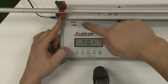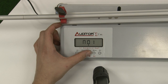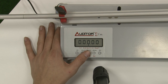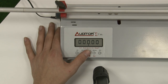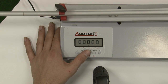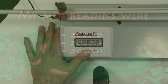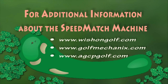Pull the bar back from the resting point to the stopping point. Release the bar and press the reset button. You'll receive a reading — write it down or memorize it. Press the reset button again, you'll receive a reading. Do this one more time so you have three readings total. The difference between the three consecutive readings, maximum and minimum, should be less than 0.05% of the calibration value. When all three readings are within 1% of the calibration value, the instrument is set up correctly and does not require calibration.